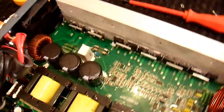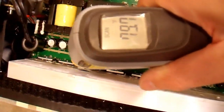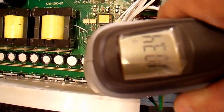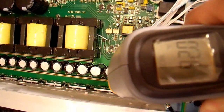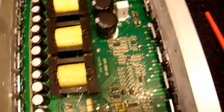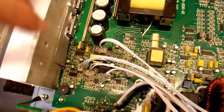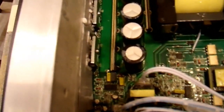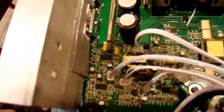I'm going to let this run for a little while and see if anything gets unusually hot, because everything should be heat-sinked properly now. Setting the camera down to figure out what's getting hot. It ran a 300-watt load for 10 minutes or so and nothing got especially hot. There is something down here that gets quite warm — one of the two drive FETs, one for each bank of transistors in the boost circuit. I don't know if one is slightly damaged, but the warmth doesn't depend on load and it seems to work fine so I'm just going to leave it alone. That's probably how it always was.